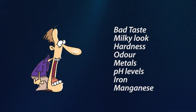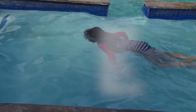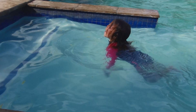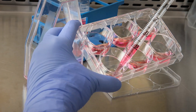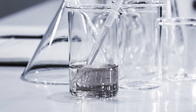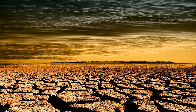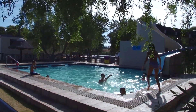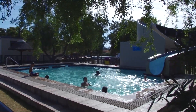You've got to be quite unlucky to have all of these problems in your groundwater. Usually the pH levels need to be adjusted and one or two other issues will need to be corrected. Getting the borehole water off to be tested is the best start to find out what condition your borehole water is in. Water is getting scarce and more valuable every year, and it's likely that the investment in a few filtration systems and a chlorinator will save you loads of money in the long run.